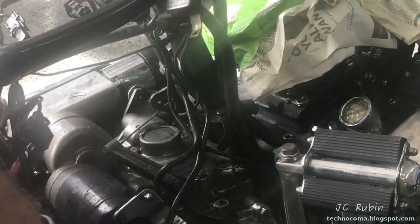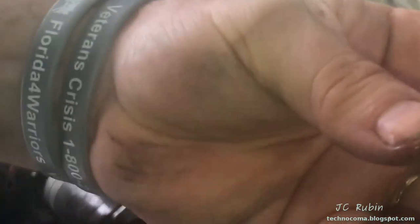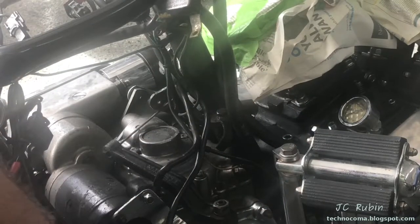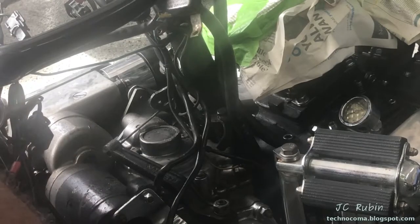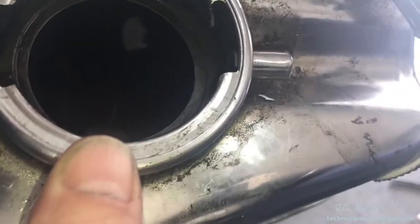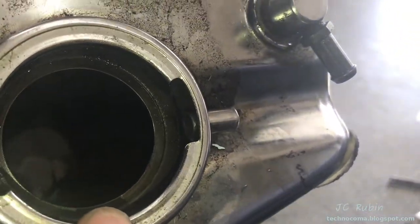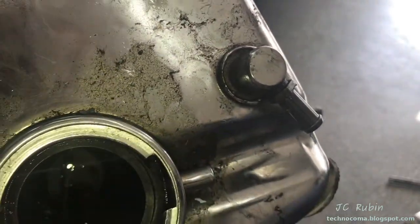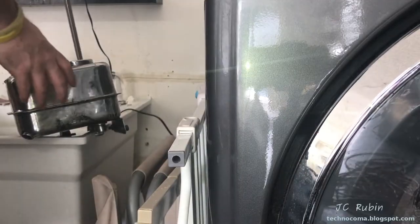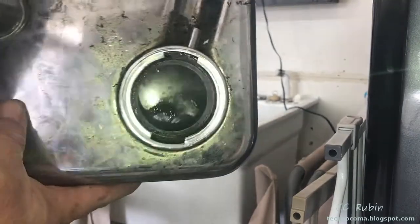We'll take a look — the cylinder walls are good. We'll look at the rings when we take the jugs off — that'll be for the next video. We're going to go a bit lower into the engine. Most likely it's the rings given the oil blow-by. We'll also look at the surfaces of the cam. The tank cleaned up really nice inside — there's nothing left, it's almost like brand new. I'm going to get the rest of that kerosene out and start degreasing.